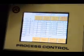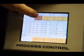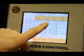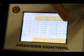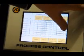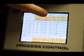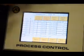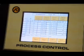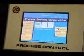Now, going over to ingredient B, which is a vibratory feeder, we have the same thing. We still have a time weight table. It starts dispensing material right around 65 milliseconds. We got a reading of 3.3 grams, 2.9, 3.0, 5.1 raise, and as you can see, the dispensed material increases as we get deeper and deeper into the weigh table. This is how we're able to grab and select weigh readings to finish up each hopper's remaining weight. So that's kind of the different technology.